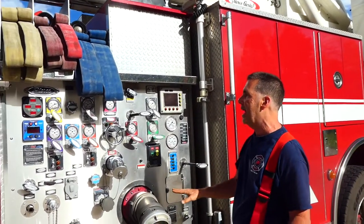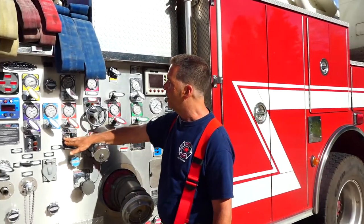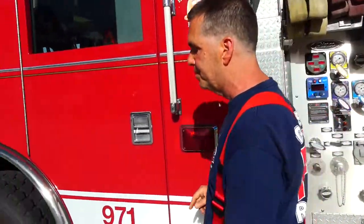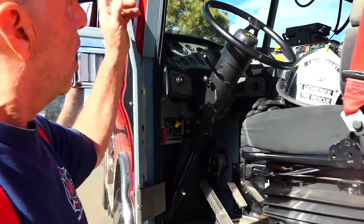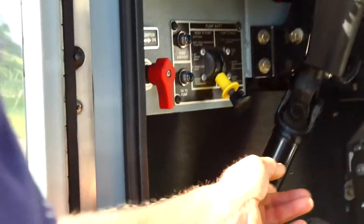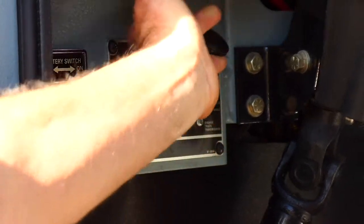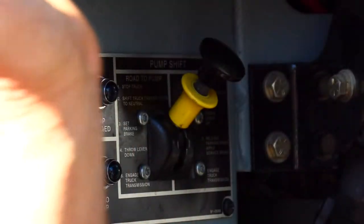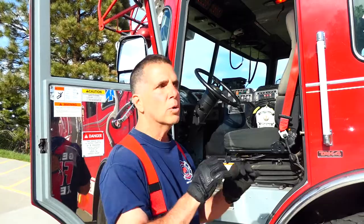When you're done, you want to shut this down. If the tank fills, just close the tank fill off. Then shut off your outside hydrant if you're going to shut the engine down. Before we shut down, we go back to the cab — you don't want to run your tank dry. In the cab, put your foot on the brake, take it out of drive and put it back into neutral. Bring the lever to the middle position, count two seconds, then bring it up to the top position — all done in neutral. If you do it in neutral, you will not grind and wear the gears of the transfer case. Now that we've explained the basics of pumping 971, I'm going to get in the engine like we're rolling up on scene, go through it, and then we'll talk about the fine details.